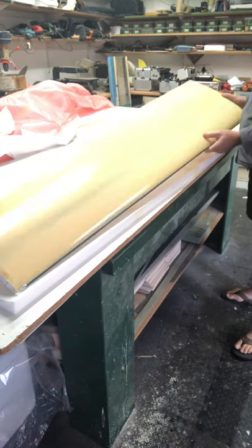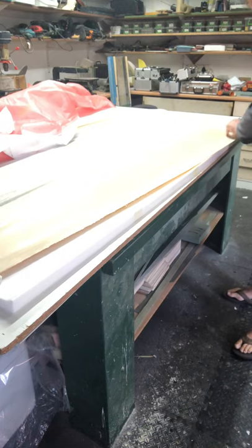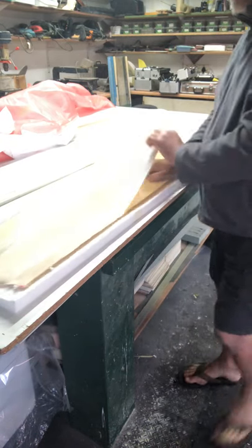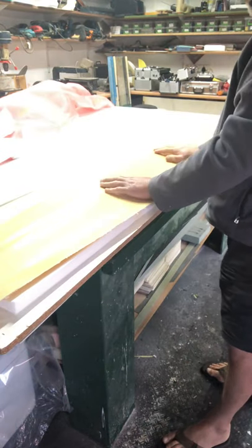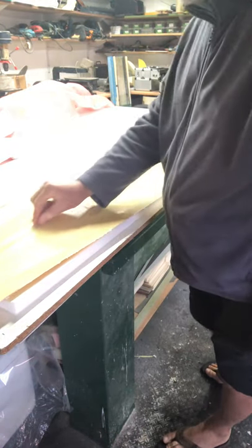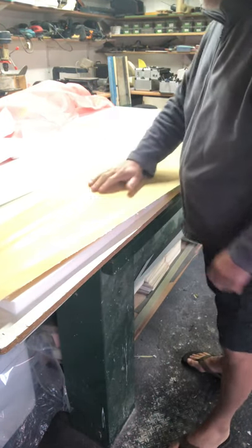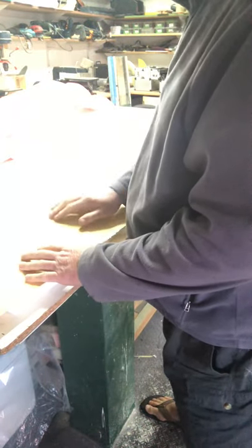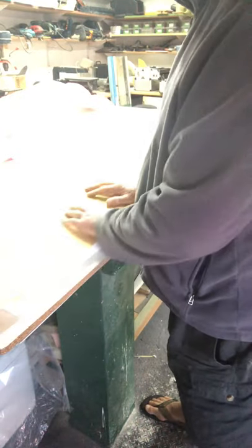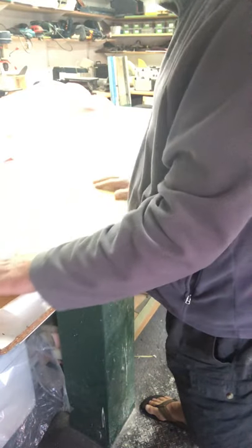And that's the whole wing revealed. Let me just turn it over and do the other side — like Christmas presents — the beautiful shiny wing now. As I said earlier, I know there's going to be a little divot in this spar cap here because it was almost impossible for me to calculate the depth of the spar needed, or the groove needed for the spar cap, so I'm going to have to fill this with a lightweight filler.